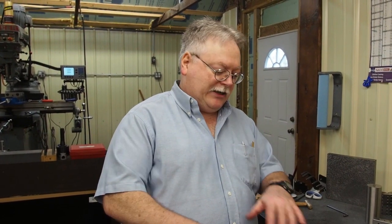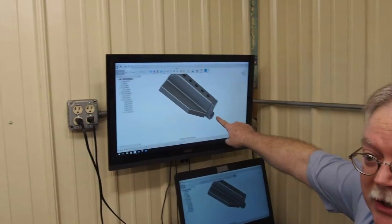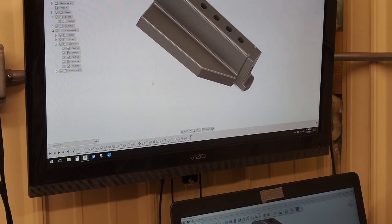With the process we used you can get a block very square, very flat, and parallel — you can do good work on a mill. You have to have a number of things going for you: good equipment, your parallels can't have nicks in them, no dirt underneath the parallels or the bottom of the vise — everything's got to be real nice and clean. You have to get the vise set so your back wall is running true, and the mill's got to be trammed in. If you do all those things and have your mill and equipment set up right, you can do this all day long — it's real fast, real accurate. So this is part one. In part two we're going to swing a radius using a boring head in the mill with the boring bar in backwards running in reverse, so for those of you who've never seen that, look forward to part two. Thank you — if you like the video, subscribe and hit a like. We'll see you next time.